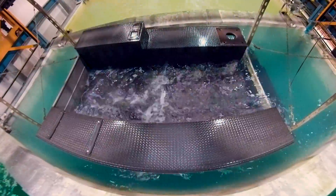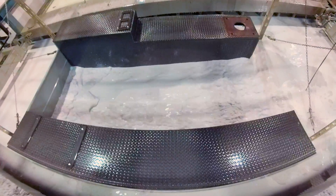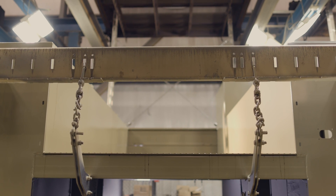Your first layer is going to be your zinc phosphate — that's going to be your biggest protection against rust. After that, the E-Coat will seal that in and it almost creates like a barrier. And then once it's baked, it's going to be completely hardened. You have to really scribe and scratch at it to get anything to come up.